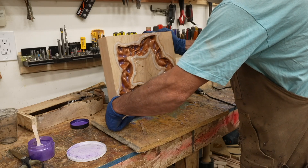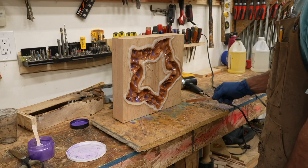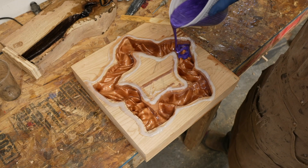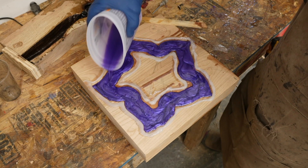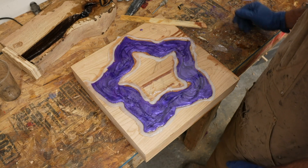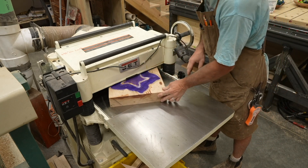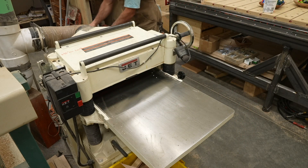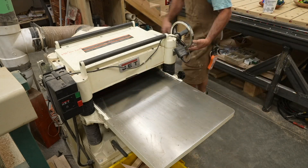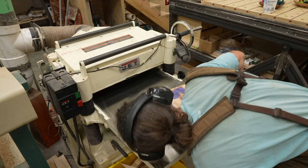While the seal coat is curing, I put it on its side so I don't get thick areas pooled at the bottom of the mountain valleys. I'll also kind of help it out a bit. While the seal coat is curing, I'll immediately start mixing up the deep pour epoxy. I'll begin the pour while it's still tacky — this way you get good chemical adhesion. If you wait for it to dry completely, you'll have to scratch and sand it a bit to get it to stick. The deep pour epoxy takes about three days to fully cure at about 70°F. After that, I can take it over to the planer and plane off the excess to get it fully flat. I plane it down to the exact starting thickness, in this case 2.25 inches.